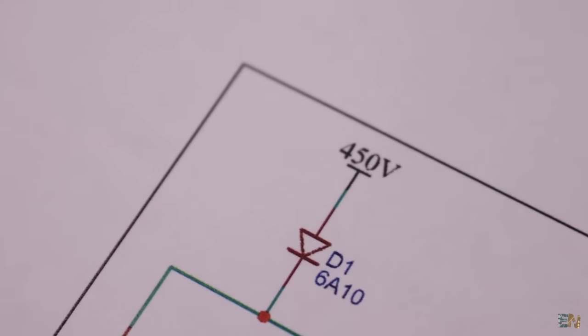And this gun needs a support, but I'll do that in a future video. Maybe a 3D printed support, that would be very cool. So I add another projectile. I put this cardboard box in front of the gun. I connect power to the high voltage module, and as you can see, we charge up the capacitors up to around 500 volts. And now we fire.